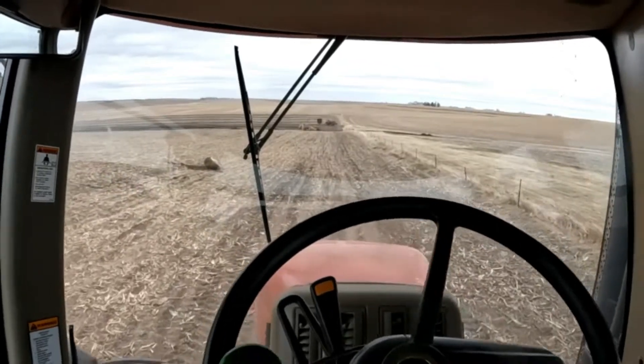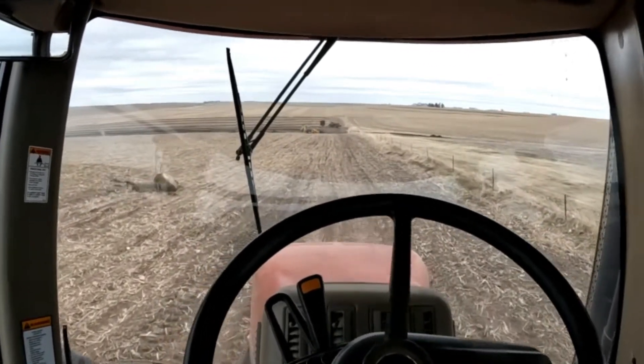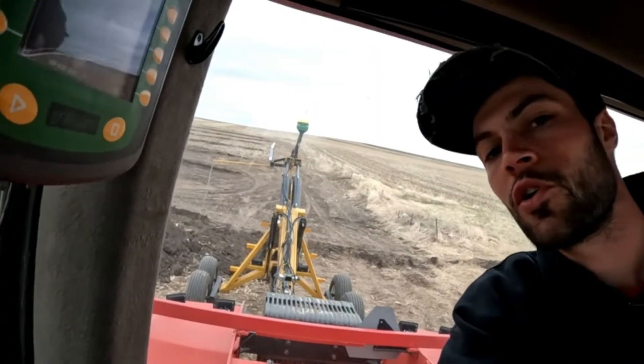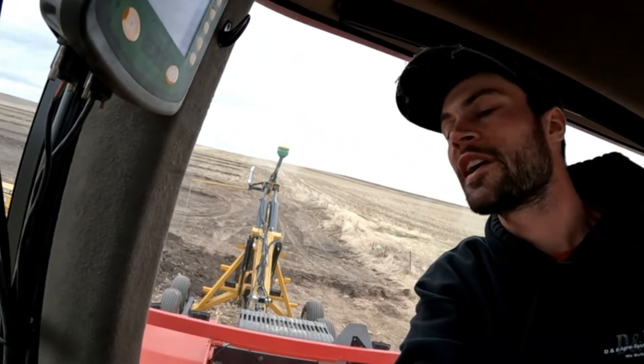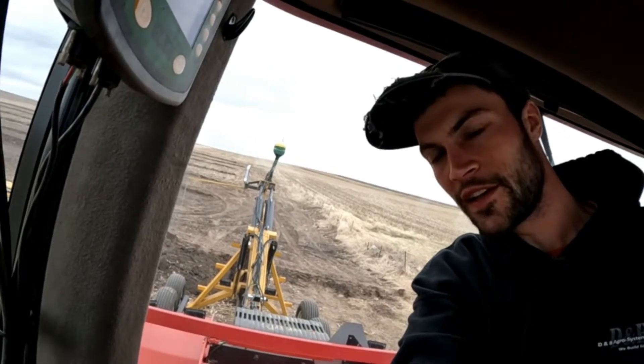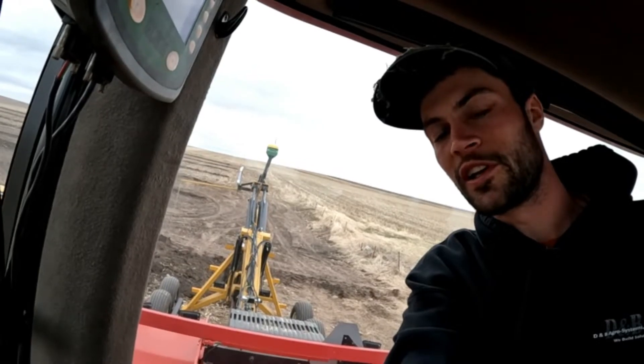It's really pretty simple — you need to have your water flowing down the hill, that's all there is to it. I'm backed up to the hole, or just above it, then Luke will feed the tile in as I get into the hole and he will make the connection he already dug to hook onto the main — the bigger lines we put in yesterday.